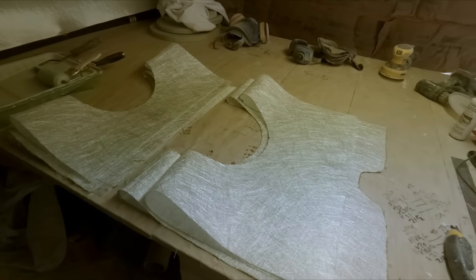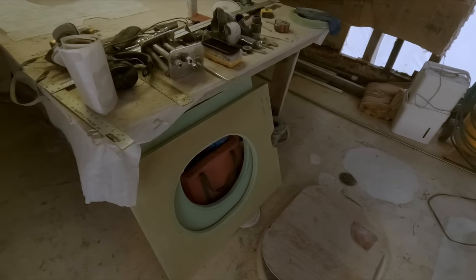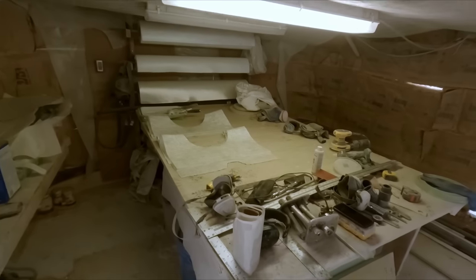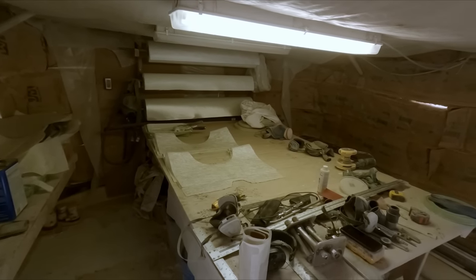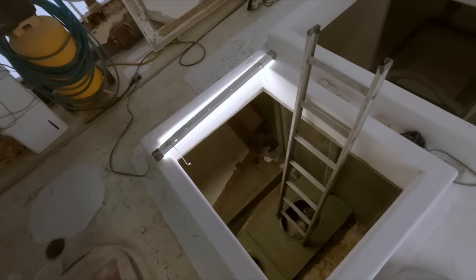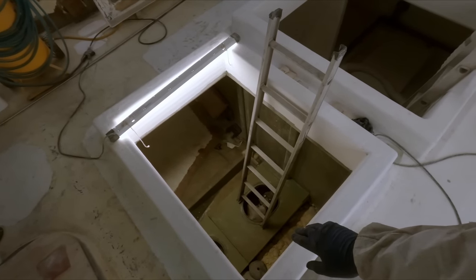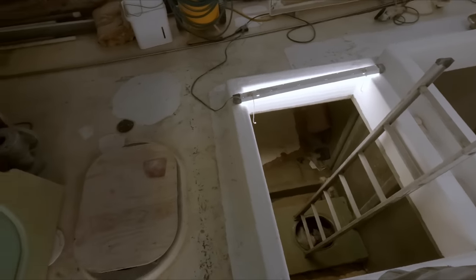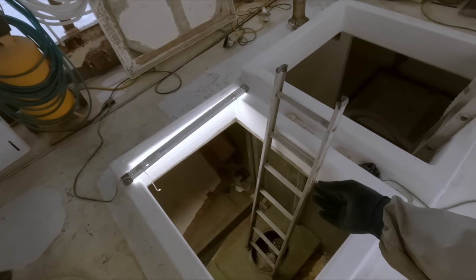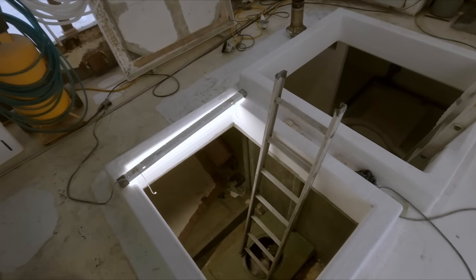All right, so we're about to put down another layer of covers. All prepped and ready. Dad got them trimmed, rounded on the edge there. I got my pieces of fiberglass prepped and ready. This is just an in-between two laminate layers, so just a layer of mat to go down against that raw foam, and then a layer of 45 to connect to this half, I guess. Just give us that kind of cushion where we can push it down and have it bond well.